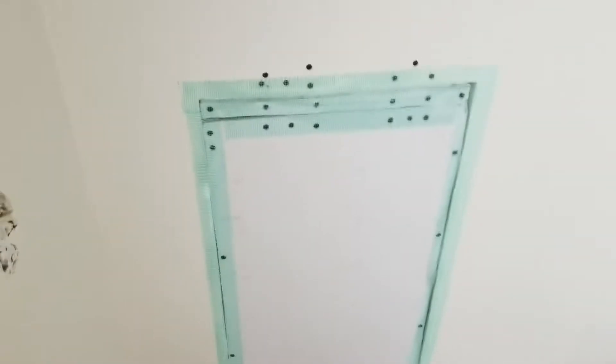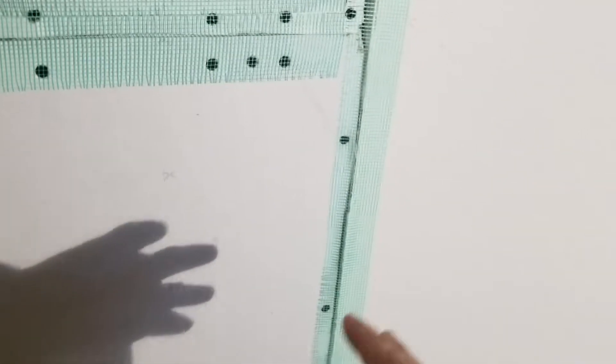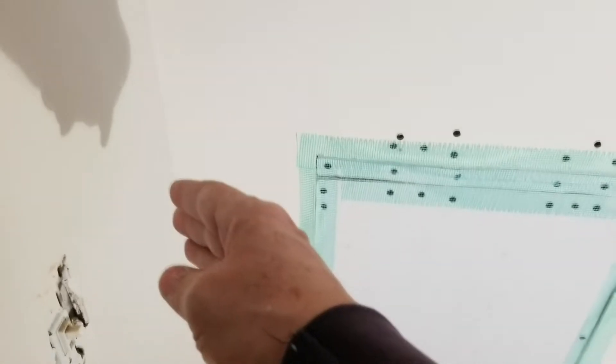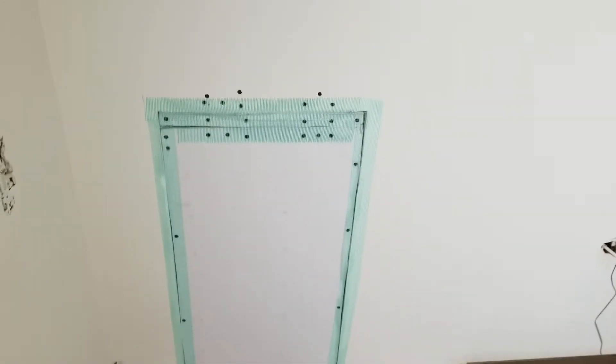I have all the tape in place now and there is a little bit of a difference in thickness on the right side, even though the left side seems to line up okay. It's just a matter of the depth of where the wood in the back was placed. We deal with this kind of stuff all the time — uneven thicknesses — so it's no big deal. We're just going to feather it, put it a little thicker on that side. We're probably going to start in the corner here on the left and feather all the way across, probably way out over here. So this whole patch is likely to be three or four feet wide by the time we're done.